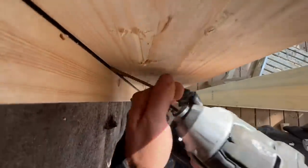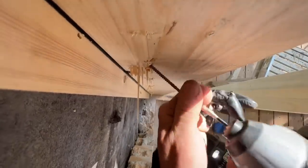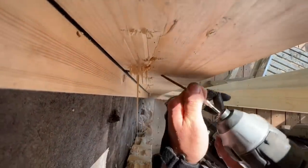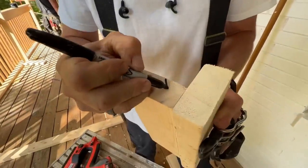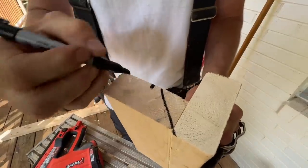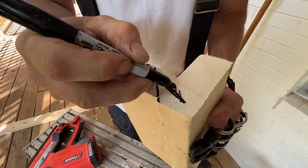Here's the tip — Eric was saying: start your screw square to the board, like 90 degrees, and then once you get it about an eighth of an inch in, you can just bend it over and get a really steep angle that's almost like doing a pocket screw. If you were a beginner, you would hold it at the angle you want it to go in and just try to get it started. The beginner way doesn't hold well — you miss out the back. What you want is to back up about another half inch, start there, and go steep like that.